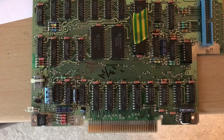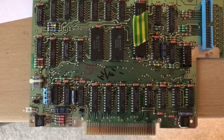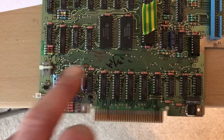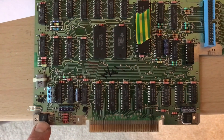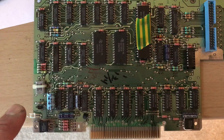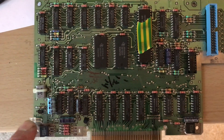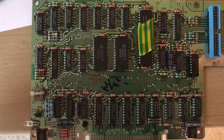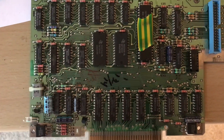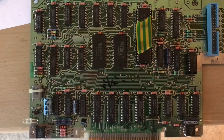Any peripheral software says the card isn't connected, so there's nothing. This voltage regulator gets warm normally — this one does not. This one has voltage, this one has voltage — kind of. So I need to look into that. I've ordered another one and I'll change it anyway, might change them both, and then we'll go from there.